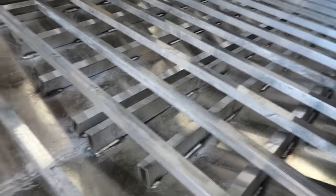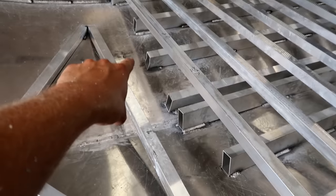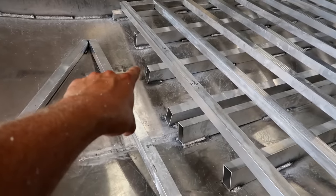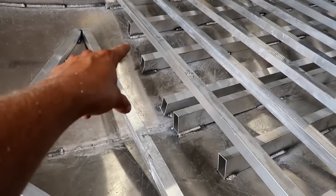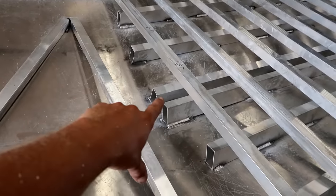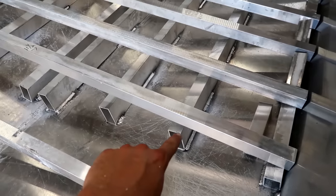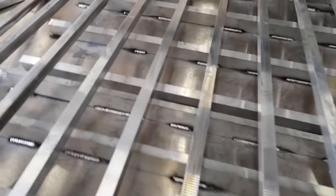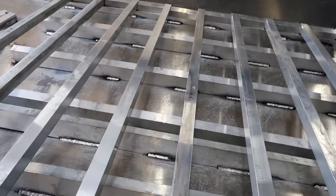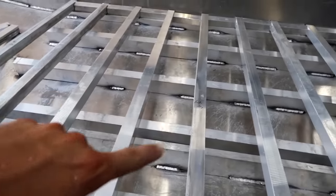What I'm doing is — you can see on each one of these bottom strakes — there's going to be a vertical two by two square welded to that on each one, that one there and that one there and then one down the center. These outside ones are so close I'm going to use just bar stock that I've got left over, three sixteenths. I've gone through and measured everything and marked it all so I knew what to cut.